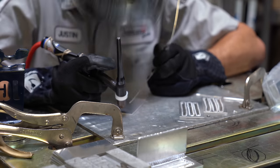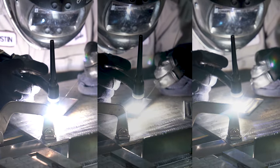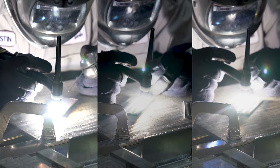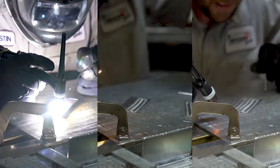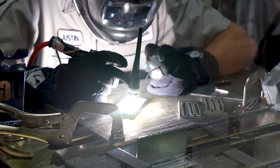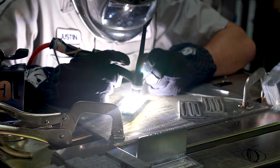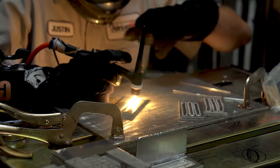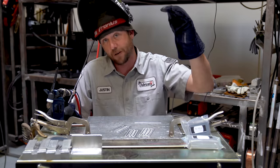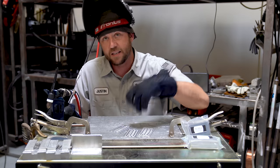Same 1/16th filler at 90 amps — this is painfully slow. I feel like I'm just waiting. What this teaches us is that we're ultimately looking to achieve a comfortable high-amperage average. We don't want to run on book settings; we want to match it to what we can do at this level based on our speed.